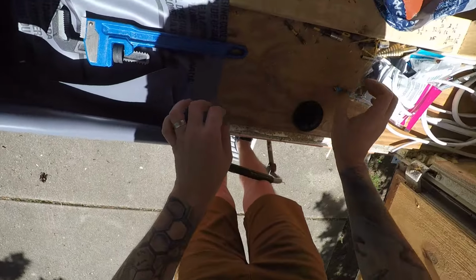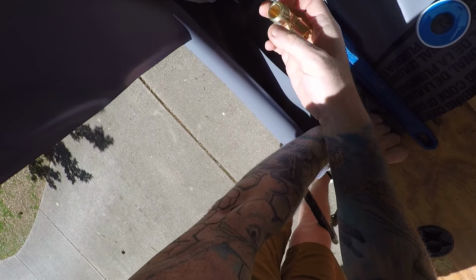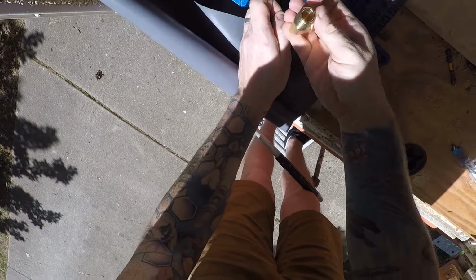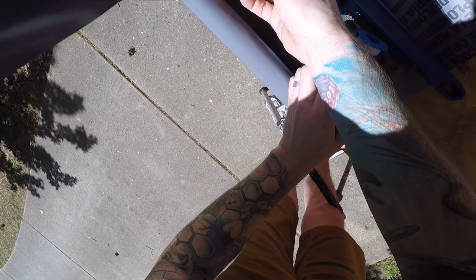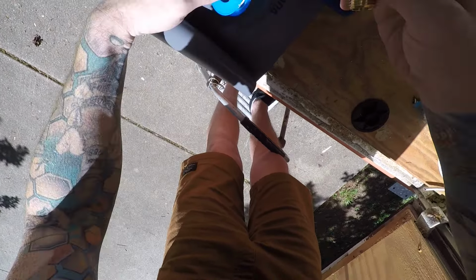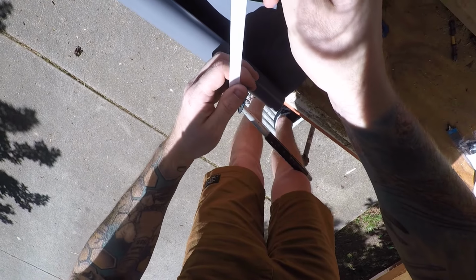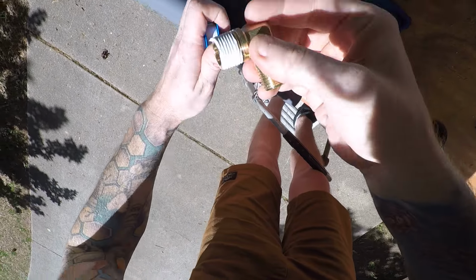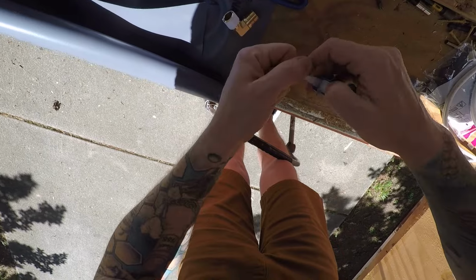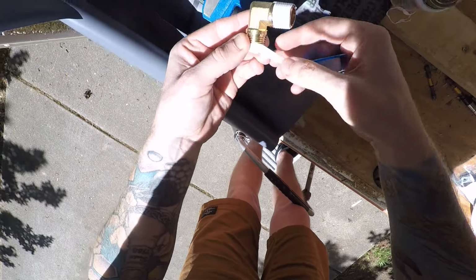I've lifted the tank, so I have room to install these fittings. I got a half inch 90 degree elbow, brass, with the male MPT threads, so that's gonna go this way to the right. And I'm gonna put PTFE tape, and when I look at the hole, it's gotta go clockwise. Yes. And I'm gonna add it on the other as well, because it's easier to do it now than after install.